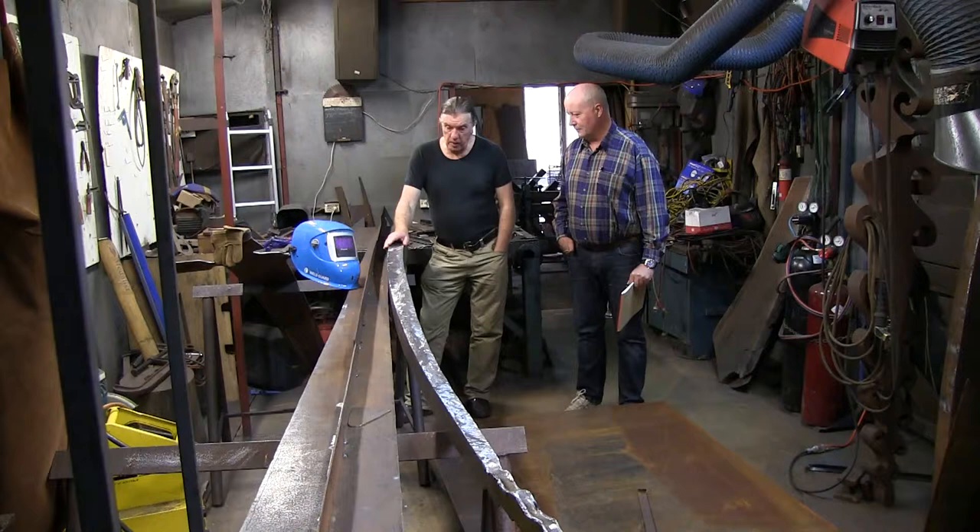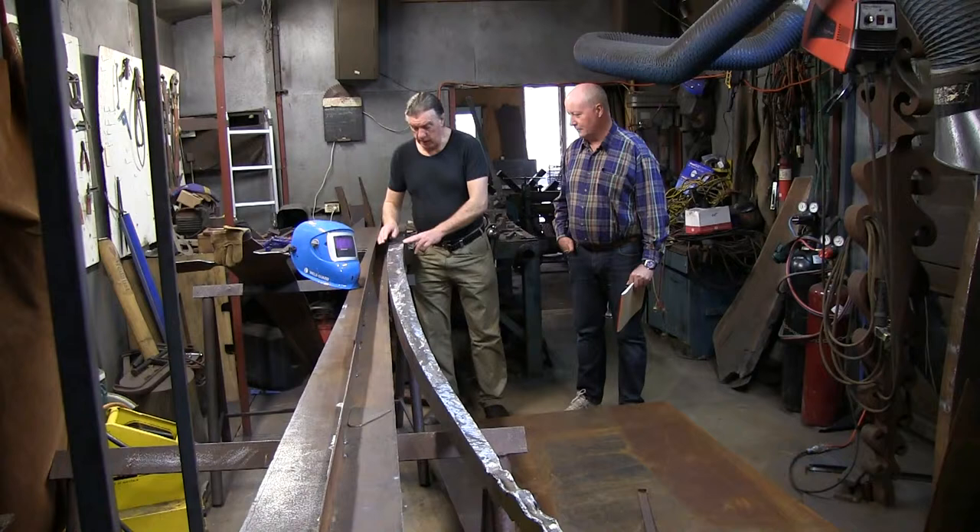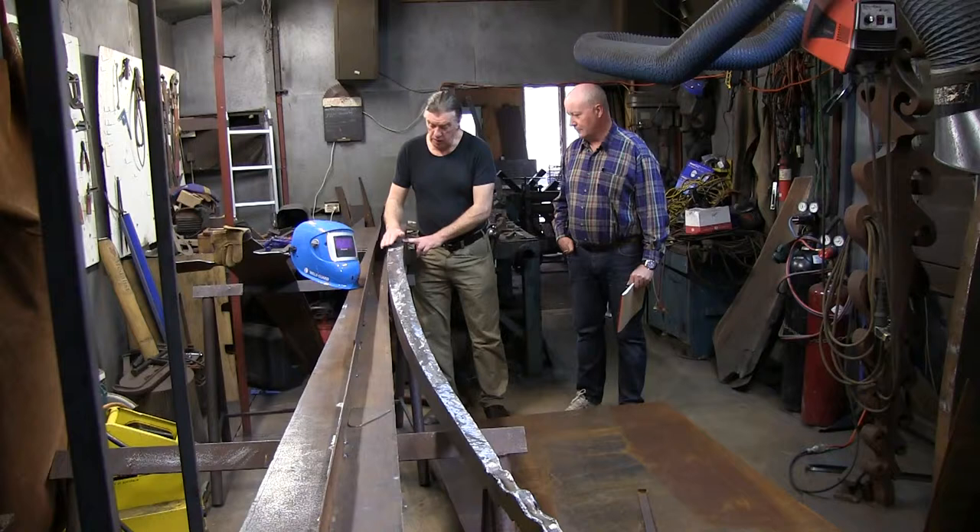It's a pretty slow process of welding the sections up. The welds initially are raised — we have to grind them, we have to use a sanding disc to get them back to quite a nice flat surface. And then with continuous division, as with this piece, all the edges are actually hand filed at the end.